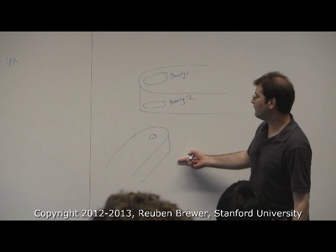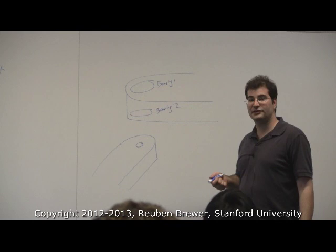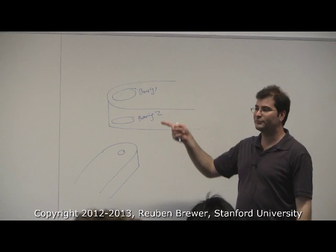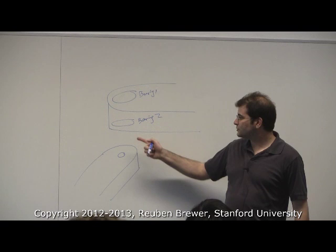All you need is two bearings for 1 degree of freedom. So remember, this could literally be a shaft that we've hammered in to press fit, and it rotates because of these bearings. That's sufficient. For 1 degree of freedom, you only ever need two, unless we do something fancy and we're talking about thrust bearings that then we're aligning with a different bearing, that's a different case. Don't worry about that. There are special cases where you use more than two bearings. In this case, for what we're doing and 99% of what robotic people do, it's two bearings per degree of freedom, rotary degree of freedom, okay?